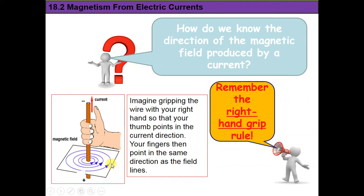Maybe you'll think about increasing the current — the amount or value of current. That's correct. We can increase the value of current, and therefore the strength of the magnetic field will be stronger. But this is not a safe way at all, because increasing the current beyond the safe level can lead to hazards or fire. So that's why we need a better solution.